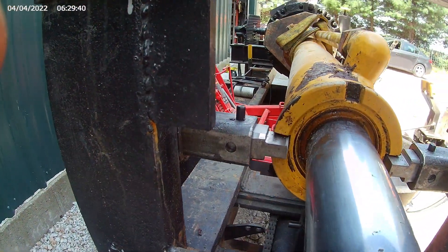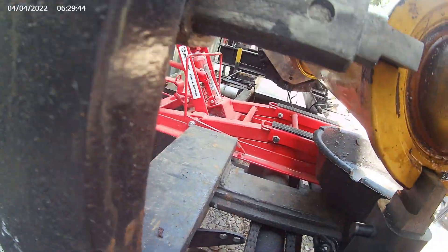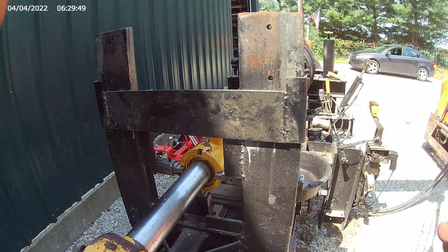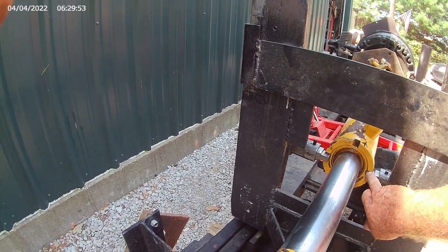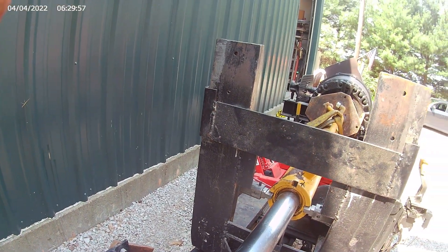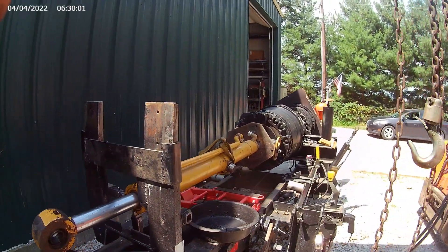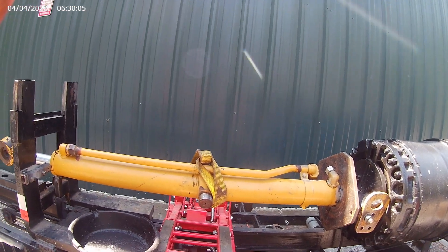Here's a better shot - you can see where it's holding the head gland on each side, and the third jaw on the bottom is just good insurance. I've also taken this table and sucked it forward to hold these tools tight into this gland so there's no chance of them turning, stripping, or falling apart. Now we're going to fire it up.